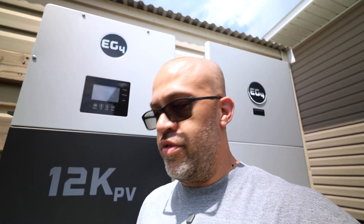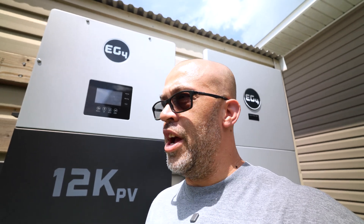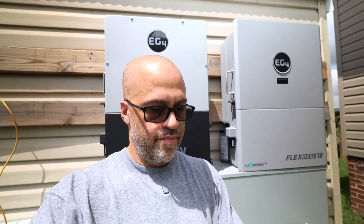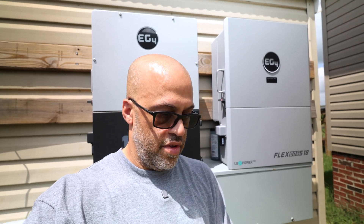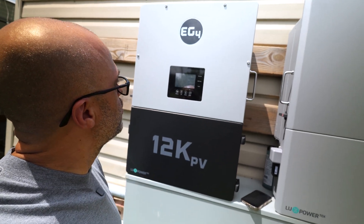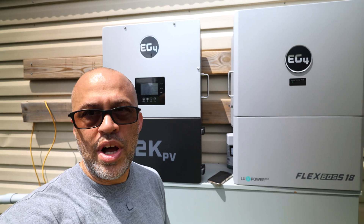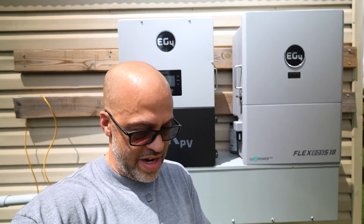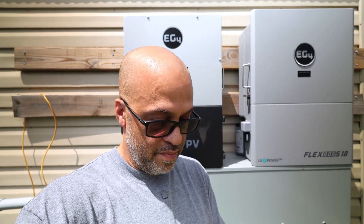I'm trying to get the app to update — it's always just a little bit behind. That's one thing with the EG4 app: it has to go to the servers and come back, so it's always going to be slightly behind. Right now it's showing about 9,700 watts going out to loads. Let's go ahead and connect the car back. At 11:39, just started screen recording again. Let me look right at the inverter — it says I've got 20.4 kilowatts coming out right this second.